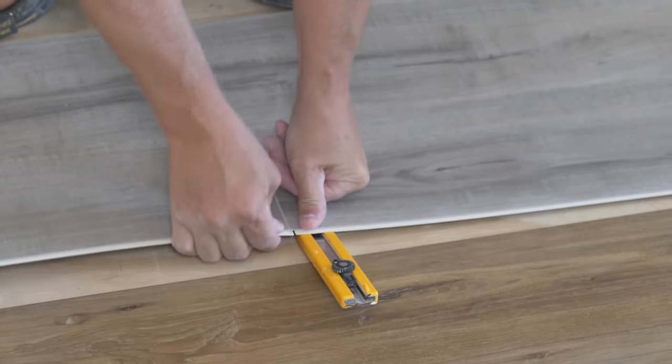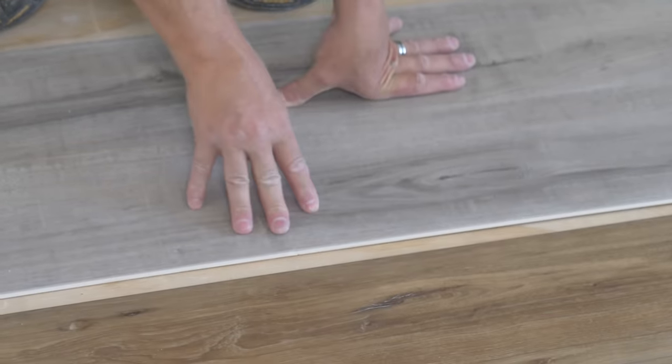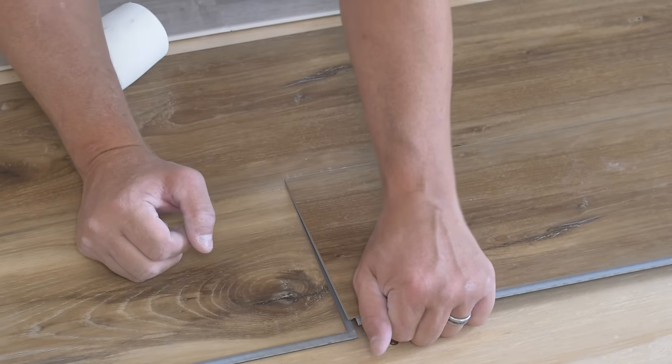That's a pretty extreme gap we're talking about in this example. The point is that tongue and groove works ten times better on uneven floor surfaces than the drop lock. Because then you come back and you lock it again — and then next week you're walking and now it unlocks even more easily.